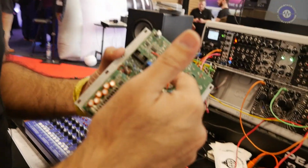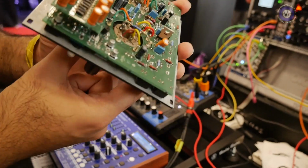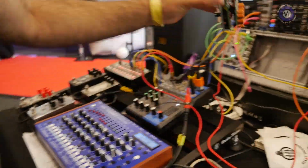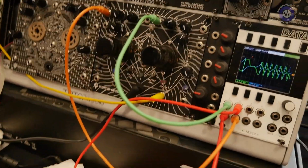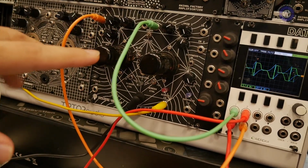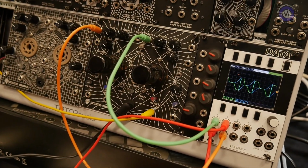It's a fairly complicated construction in the sense that you've got some free wiring. This has the massive advantage that if you decide to use any other tube type that fits the socket, the user can just probably rewire the socket himself. Right. So what tubes are you using? The tubes being used here are 6SJ7 metal can pentodes from the 1950s.